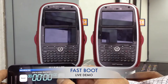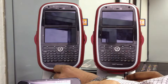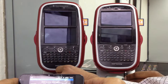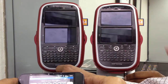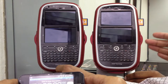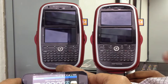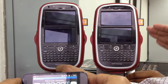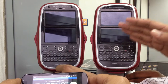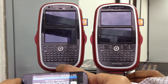What we have here is the demo of our fastboot, currently implemented on OMAP4 among various other platforms. The one on the right is where we have the optimized code running. Both have the OMAP4430 running at 1.0 GHz. The one on the left is the standard Android drivers from TI. They are running Android Gingerbread.